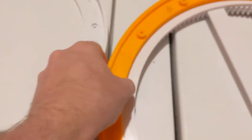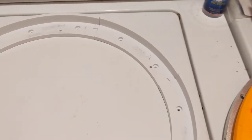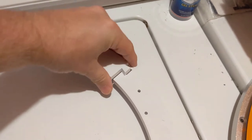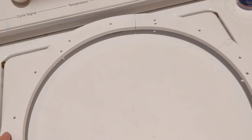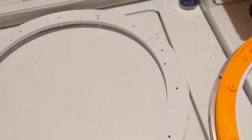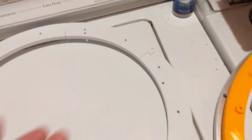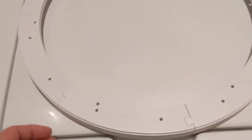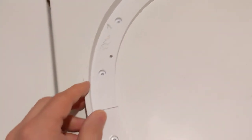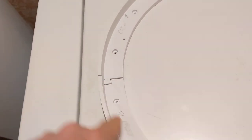Okay. The Lazy Susan sits in this. I've got a Granite Earth Lazy Susan. This is the file, and I don't think it's named Cut Granite Earth Lower Ring. It might be. It might just be listed by dimensions. I want to say it's just listed by the diameter of the Lazy Susan. The main thing to remember is you want your Lazy Susan to fit in here and not bind up on this inside lip, because it needs to be able to spin.